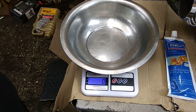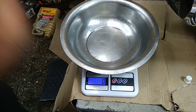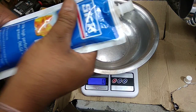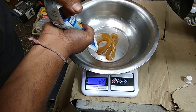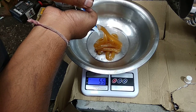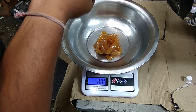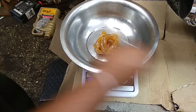First we'll zero the scale. I'm going to take around — this is AP3 grease, so white grease. Don't use black grease or hub grease — that black grease which you use for hub greasing. So first let's check: 50... almost 100 grams you can say I have taken.